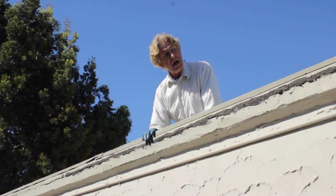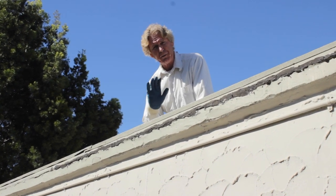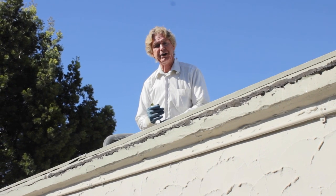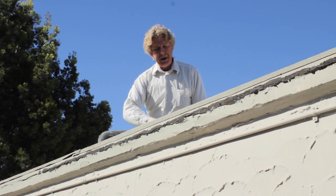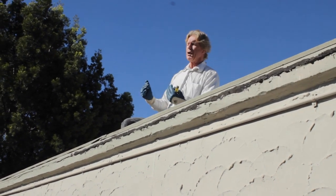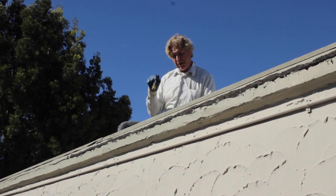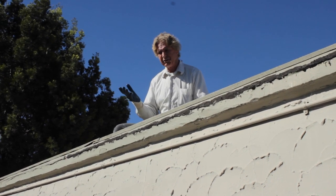You've got a parapet roof. Parapet roofs last about 50 years — they'll last a thousand if you keep it prepped, meaning you paint it every ten years. As a rule, these parapet roofs have the stucco going here and a membrane going here. The sun bakes it; we're on the southwest side here. In a hot area like Arizona, it'll bake this in about 30 to 40 years. As a rule, they last about 60.